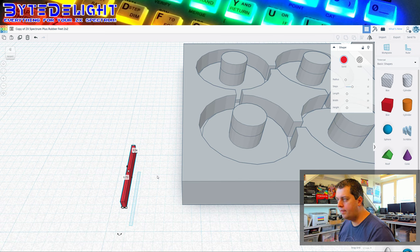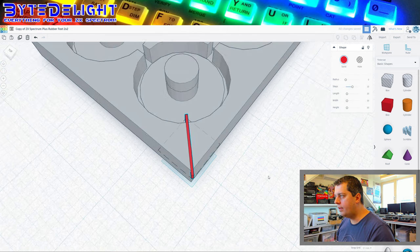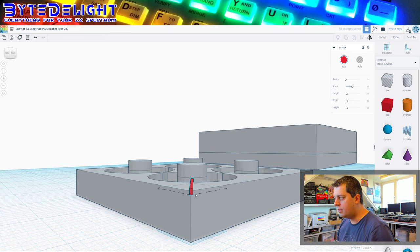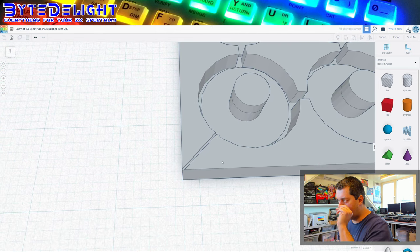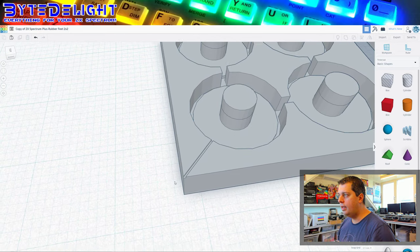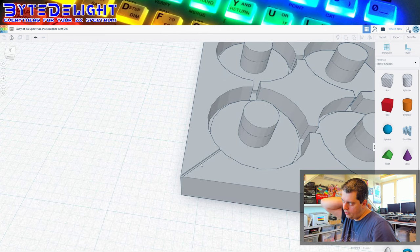It's already 0.34 so it's almost there — let's make it 0.25. Now it's 0.25. I'm going to rotate it so it's quarter of a millimeter wide. I think that will do. Still a bit high — let's do it this way, now it's 25 by 25 — it's really just a small amount just to get the air out. I need four of these. Let's make it a hole — if I join these two parts you can see the line going out just for the air to escape.